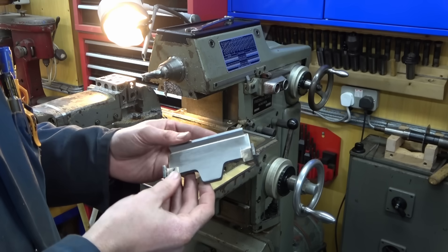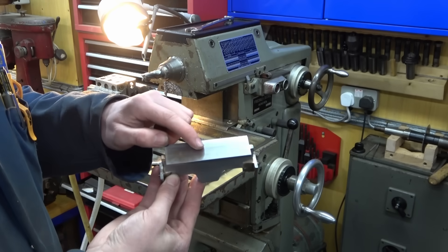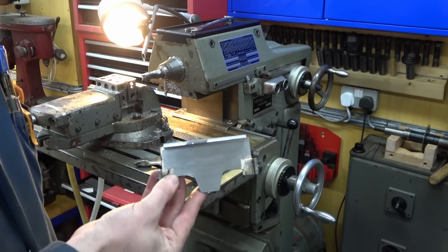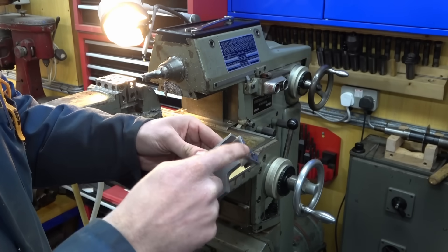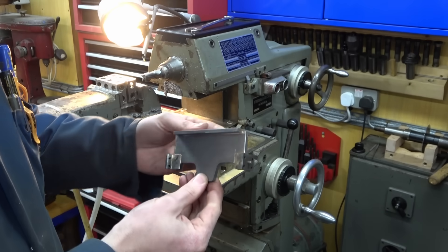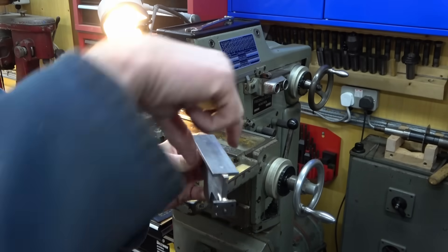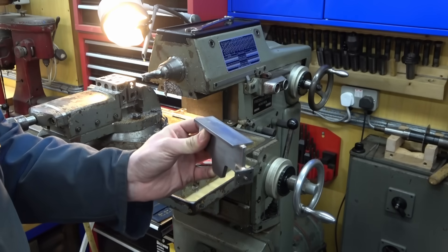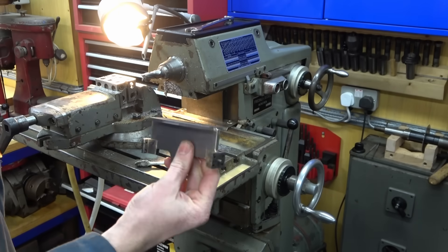It's had a bit of a file-up, and I've put it back in the milling machine and taken a bit off the top and done this face here. I've then taken it to the surface table and measured various dimensions — such as the relationship of these holes to the base and other bits and pieces. I'm now going to put it in the vice this way round so I can take this side to finish width, take the top to finish height, and then turn the vice through different angles to get to all my other features.